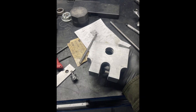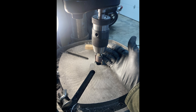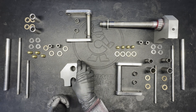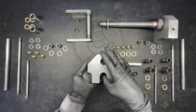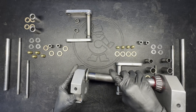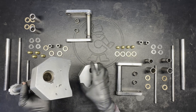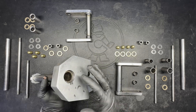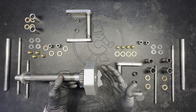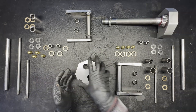I started shaping this mostly with my drill press — it was not a great tool to use, but it did the job. After a lot of sanding and shaping, this was the end result and I'm pretty happy with it. You can see it's a really snug fit. I did that for both the upper and the lower, because aluminum can have a tendency to gall when you press steel through it. So I machined my stem holes to be a slight press fit, to the point where I can just heat it up with a torch and it'll drop right in, and when it cools down it shrinks around the stem and creates a nice tight fit.